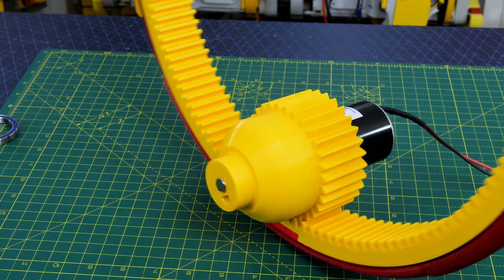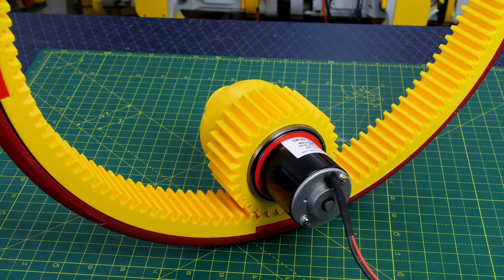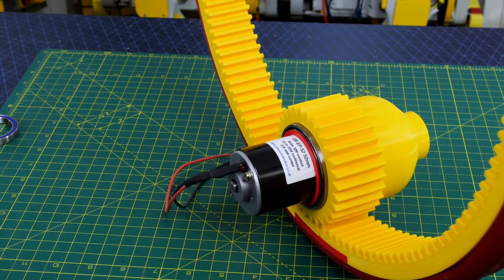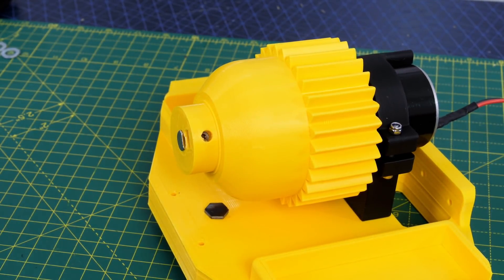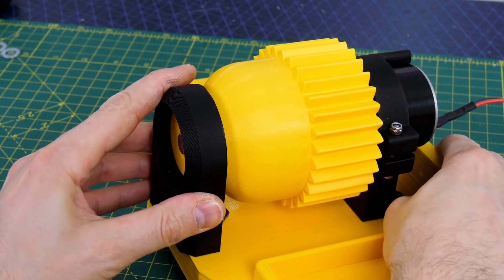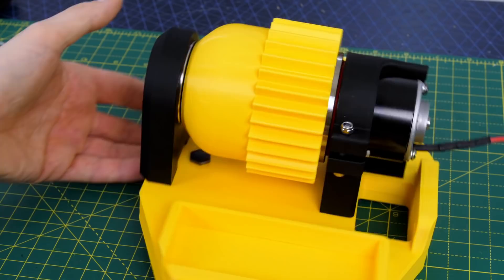The reason for this is that it makes things much better balanced — the motor doesn't stick out of one side of the gear track where it would bash on the ground as we lean over to steer, and the mass is equal on both sides. This motor fits into a bracket that fits onto the base for the whole thing, and there's another bearing on the nose of that spur gear that fits on an extra support so it can handle the load of everything on top.